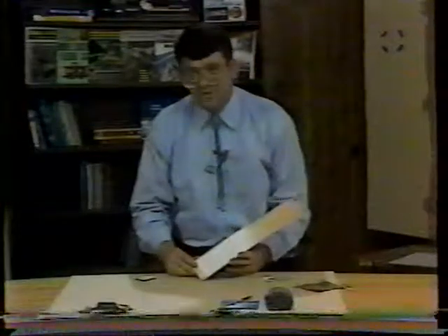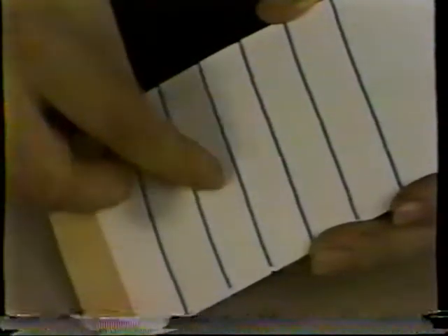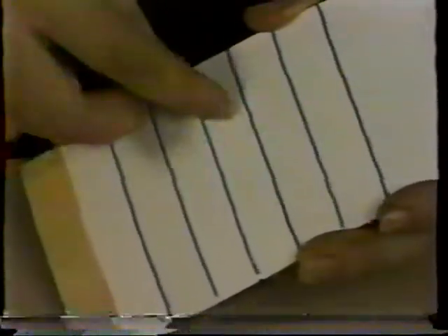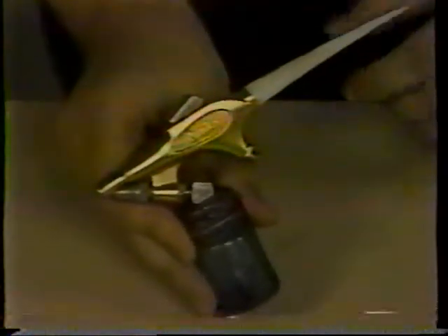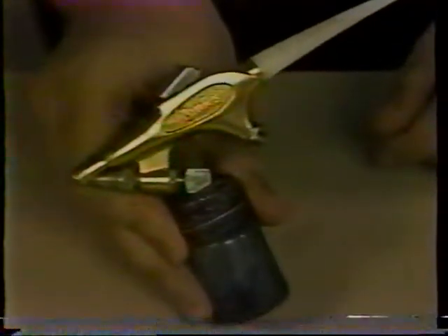To get a smooth finish on wood, coat it several times with paint and sand between coatings. Here's an example: raw wood, first coating brings up the fuzz and makes it worse, then first sanding, second coating and sanding, coating and sanding repeatedly. Multiple layers of paint and sanding will give you a smooth, fine finish. Probably the best tool for this is a simple airbrush — using an ordinary brush sometimes leaves a texture.